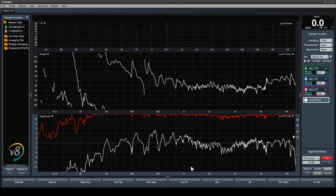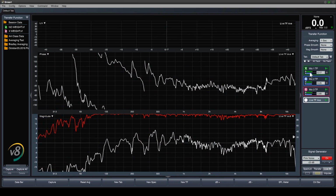The next topic that I usually talk about is setting delays. Setting delays can be as simple or as complex as you feel they need to be. They can be adjusted physically or electronically. Electronically is usually easier, if available, and yields a more refinable result. Physical adjustment can be very cost-effective and practical, but it's hard to repeat because you're physically moving speakers around in the room. Measurements can be made a few different ways.